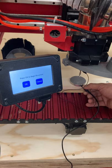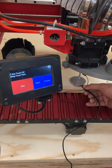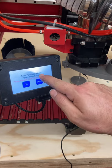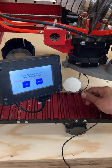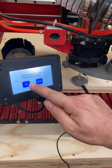I'm holding the touch plate flat because it's a smaller piece. When I click OK, the machine is going to move the bit down until it just touches the touch plate — hence why we call it a touch plate. Then it says the touch found at Z is 0.370. Do we accept? If everything felt right about that — if it wasn't cocked — then hit OK.